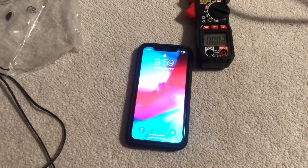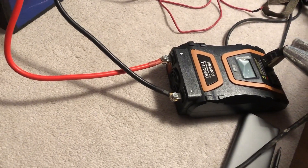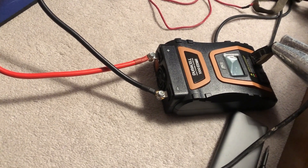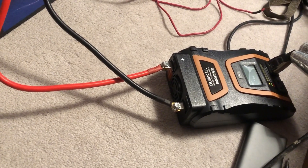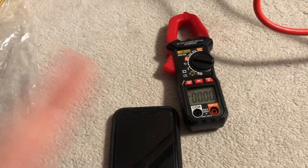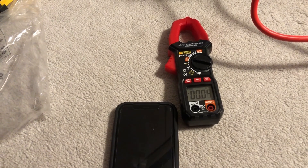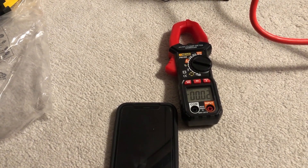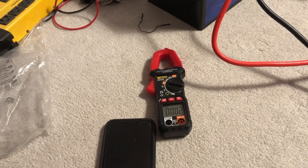As you can see, it is 9:59 and the battery just cut off on me. It didn't completely die, but it hit the low voltage cutoff for my inverter. So it lasted from 6:06 to 9:59. I'm going to do some rough math based on average amperage it was drawing. At first glance, I believe it reached its 100 amp hour rating, but I'll quickly do the math and get back to you.